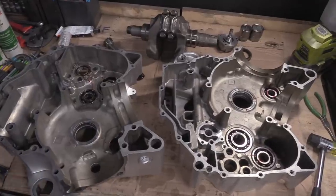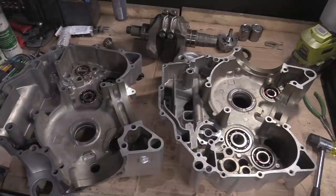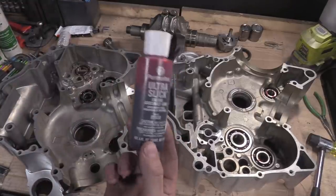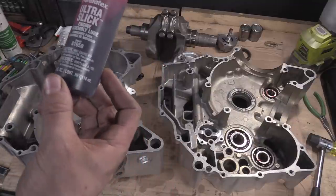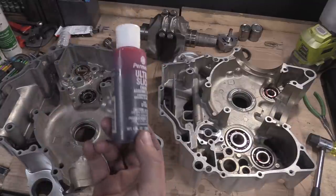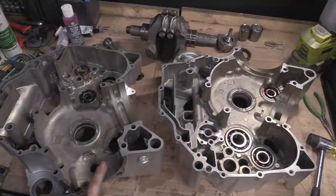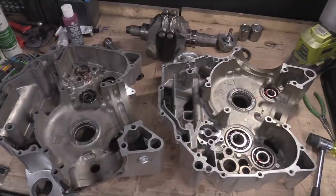So yeah, like I say, for an engine, I'll probably go through one of these little small ones. This is 4 fluid ounces, 118 mil. About a half to one full one. It depends how many bearings, how many bits and pieces, how many cylinders. Depends on the camshaft, you would take that up like it's going out of fashion.